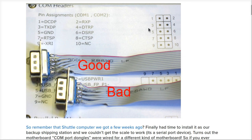Now, on the Retro, I numbered the pins this way in KiCad, and I can talk about that in another video. The short of it is, if you number the pins this way, then you use the default footprints when you're designing the copper traces on the circuit board. It turns out that the majority, at least by my experience, of all the copper footprints expect you to number the pins this way. If you don't number them this way, they don't match the copper, and then you have a whole other problem. So you end up numbering the pins on a rectangular header quite often.